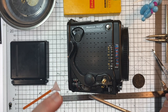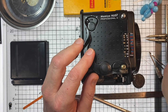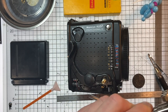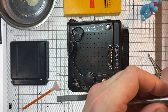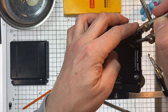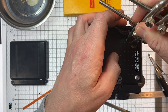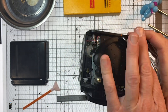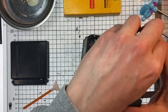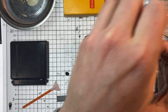With five body screws removed from the upper body, we can now take off the MR lever — you're going to need a spanner wrench. It won't need much pressure, and try not to scratch it. Be a bit careful. If it does need much force, you're doing it wrong. The retaining nut comes off, and the MR lever slides off. Beautiful.